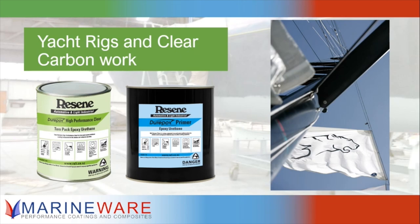This picture is from a big race boat — the rig was painted black in just the primer, which the crew preferred as it reduced glare so they could see what was happening at the mast when trimming sails. However, as the boat went around the Med series and onto Australia and all over the world in lovely warm places, that primer — although impressive for UV resistance for a primer — still wouldn't cope with those conditions and would go a bit milky towards the end of the season.